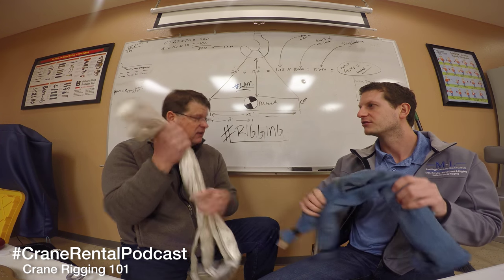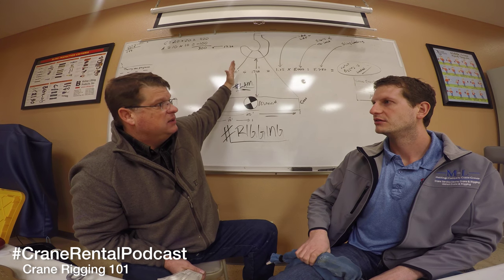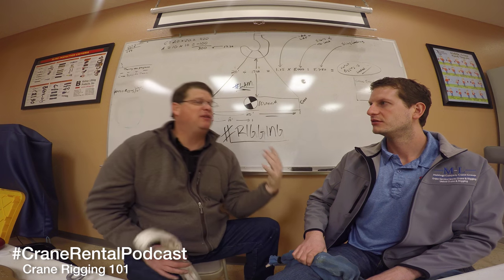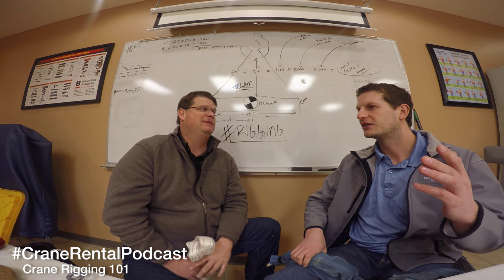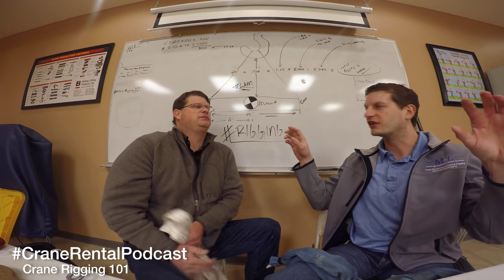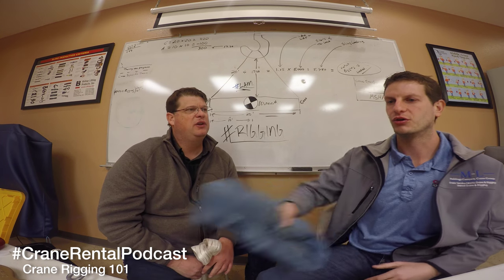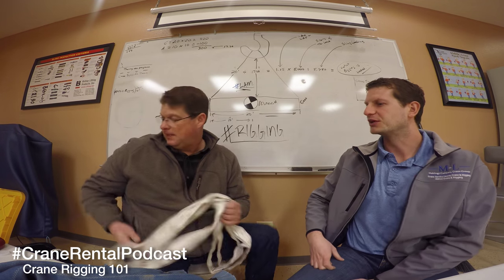So you can't just roll up to a job site and say 'I have a 5,000 pound sling, let's lift the world' - you need to know what's actually happening mathematically and scientifically. The other thing to remember is when the angle increases, we're also compressing that load. So you may have a load that can't handle compression - like roofing metal or a long flat piece without much structure - and you'll bend the heck out of it. Your attachment points maybe can't handle those angles either. There are a lot of situations to consider.